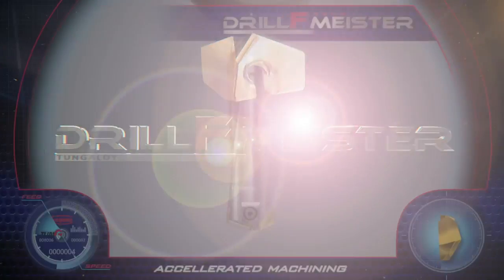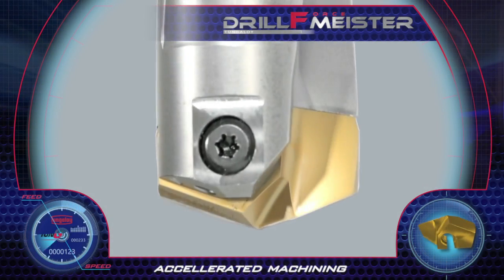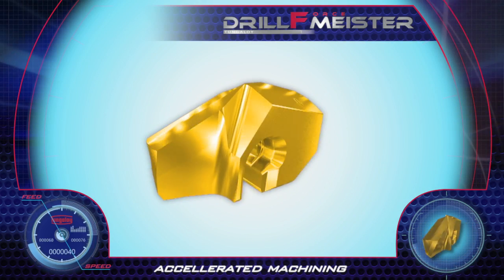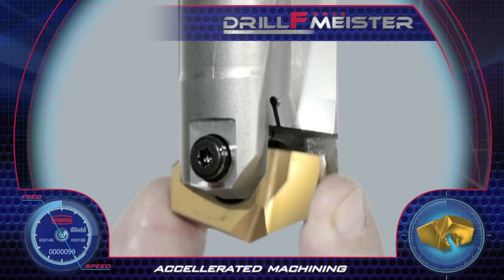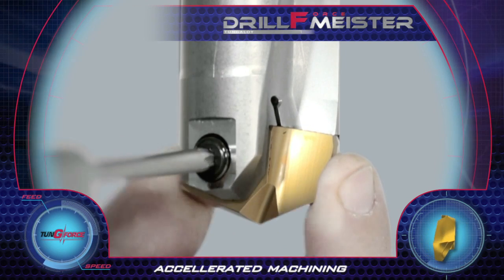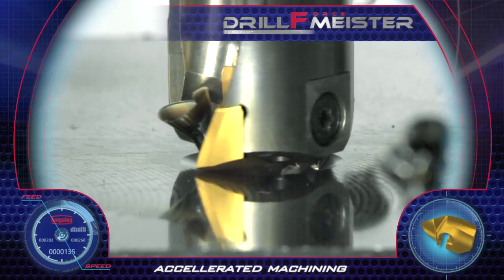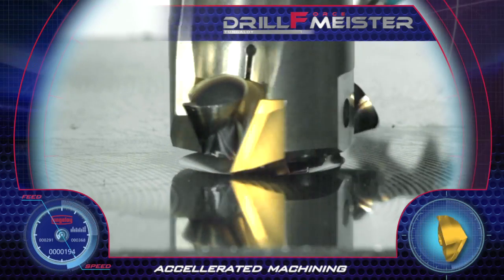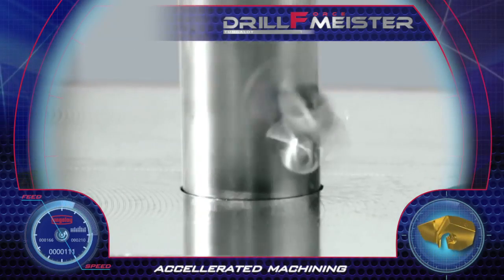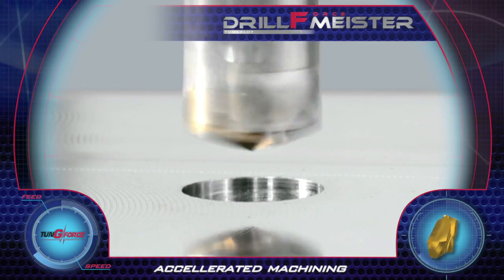Drill Forcemeister. For drilling highly accurate large hole diameters, Tungaloy's new advanced Drill Forcemeister provides an insert with 2 effective cutting edges. The quick head change can be performed on the machine, consequently reducing setup time. The insert has positive rake angles for a soft and easy cut, and the straight cutting edges deliver extra strength and provide unbeatable chip control. Accelerated drilling and very high productivity achieved with Drill Forcemeister.